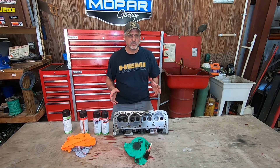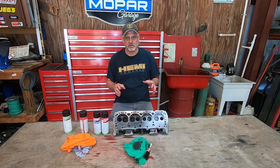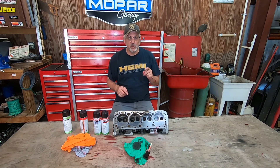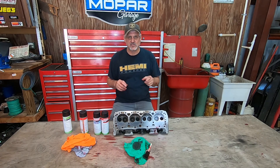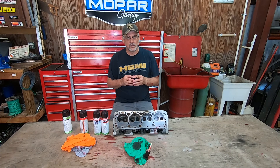So now you can see it's a pretty simple process — easy to screw up, but really simple. The biggest tip is on the penetrant application: don't treat it like spray paint and spray it all over the place, because you'll get it everywhere you don't want it and it'll take forever to clean up. Make sure your part is clean before you start and remove any paint that's on there. Cleanliness is the big key. I hope you learned a little from this video — some do's and don'ts to help you out. Please hit like and subscribe. We're going to bring you more videos on non-destructive testing showing different components and ways we do inspections. Thanks a lot.